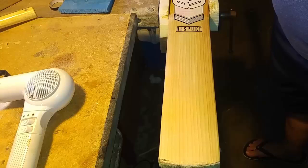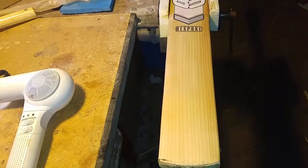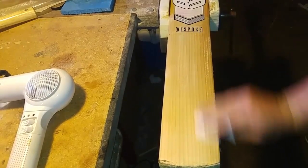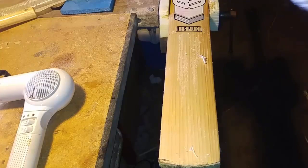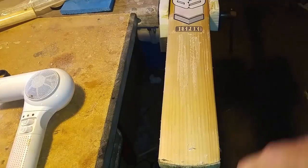Now to get the glue off. The easiest thing to use is mineral turpentine, which is used to thin down linseed oil in furniture polish, so it works well with linseed oil anyway. Just put a bit on a rag or a paper towel — it's all about elbow grease. Paper towels will break away, that's no big deal. Bat makers sometimes will just leave it overnight for the glue to set and sand it off, but obviously we don't want to change the weight of the bat, so it's easier just to take it off with turps.